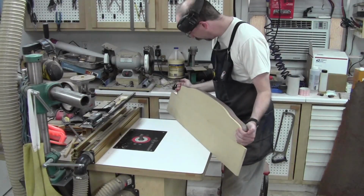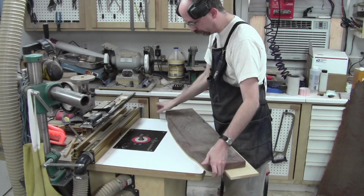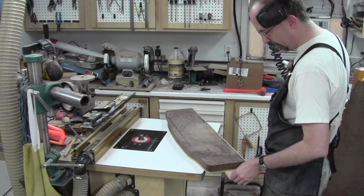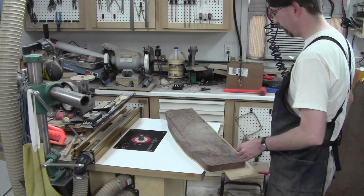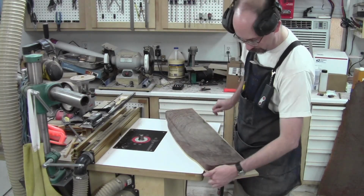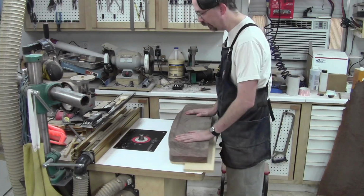We're about a 1/8 in some places, 1/16 in most. Fairly little bit to flush trim. I've got a good old size flush trim bit in here. Anyway, so I got this flush trim bit with the bearing just barely surfaced. It's going to ride along the side of the pattern. We're just going to get after it. This is why I have this shim here, so I can keep it flat against the table.